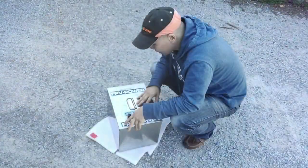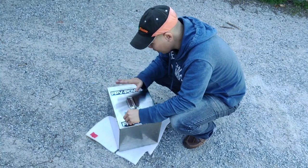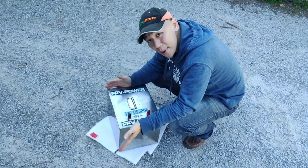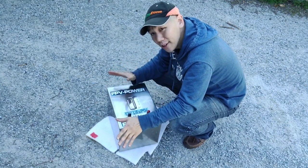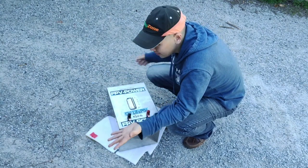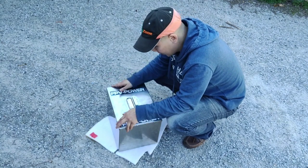Yeah, thank you. He asked, what can you fit in the bays? The maximum you can fit. So I crunched the numbers, and I told him you can fit 900 amp hour into the space that you've already got. 900 amp hour at 12 volt. That is a whopping amount of power for a motorhome.